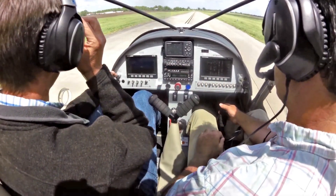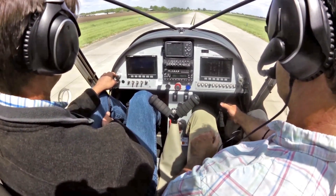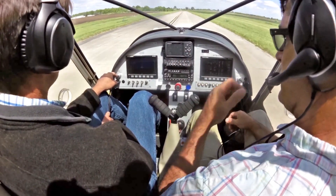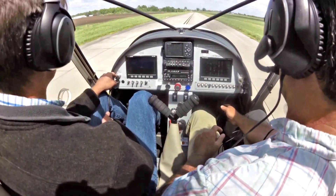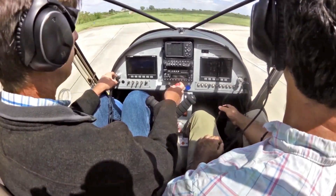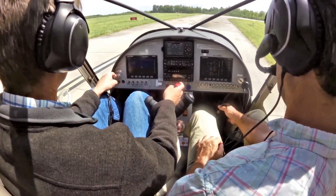Presumably you wouldn't need dual controls necessarily with hand controls like that, but that's something we'll just have to see where we want to go with it. This is more of a proof-of-concept prototype — trying it out and seeing how it goes. The actual control system on the airplane we really haven't adjusted or changed at all; all the changes have been just connecting the foot rudder pedals to the hand controller. It's really quite light on the forces and works quite intuitively.